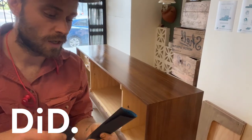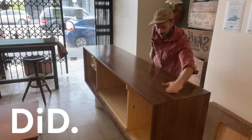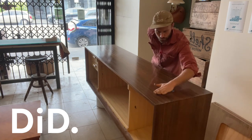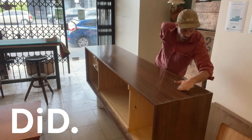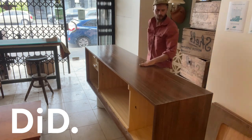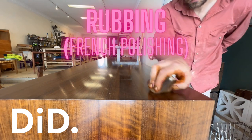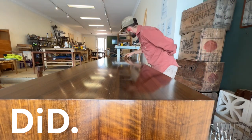So here we're going to give it a quick sand with 1200 paper, which is really, really fine sandpaper, and we're going to do some French polishing. This is really just skimming it across — getting rid of any dust or brush marks if you're not really even. Even when you're rubbering, it can not overlap as nicely as you'd like. So really smooth in between every coat once it goes dry. You apply coats of shellac, and as they dry, you give them a nice paper, do it all again — keep flattening, keep polishing, keep flattening, keep polishing.